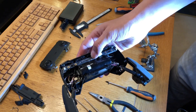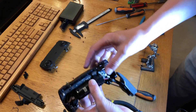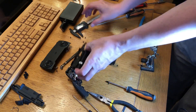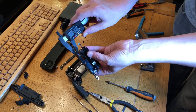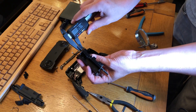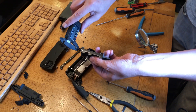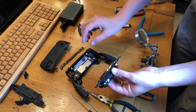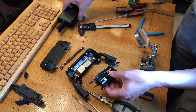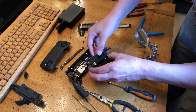I'm finally there — I've got the power socket lined up correctly. This button works, this button works. So what I'm going to do is just measure this and see what the perfect width is. I've had to shave that down to about seven and a half — hang on, seven point two — and it's about three and a half thick. On this side it's about six point eight and two point six mil thick, maybe two point five. That's taking a lot of messing around. The good news is when I did put it back together I did have control of the aircraft. I've got that stick fixed by shoving that wire back in. It started chucking it down with rain, but I'm confident when this goes back together it'll be done.